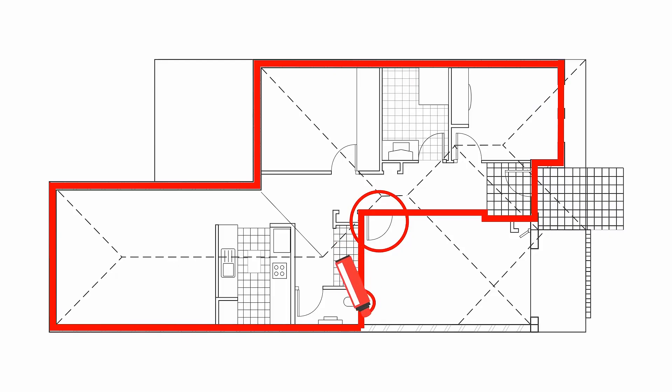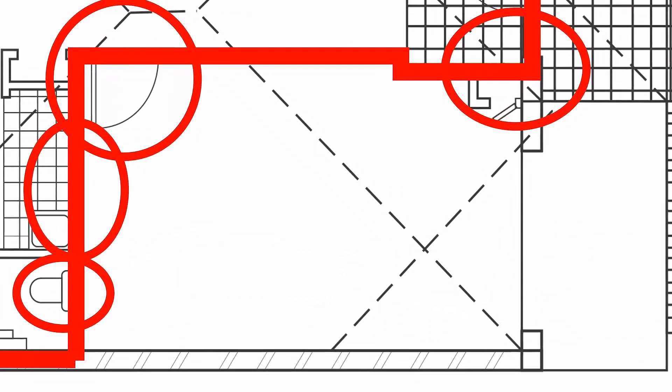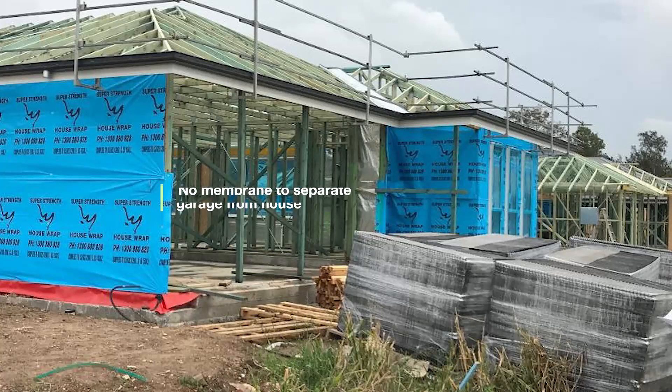What about all these plumbing services on the wall with the garage? Those are on the inside of the envelope - run your building wrap or air barrier around this wall as if it was outside. And this box for telecom services doesn't need to be inside either - run the membrane behind it, keep it outside, and seal it where it pokes through. That's how the pen test can very simply help you plan where your membrane or air barrier needs to be continuous and where your air sealing efforts are going to be most effective.